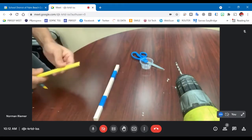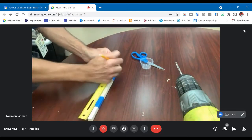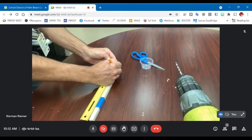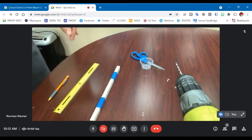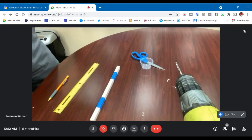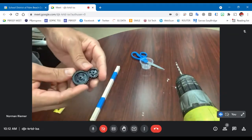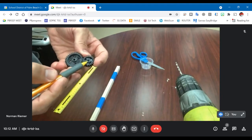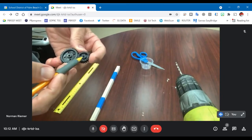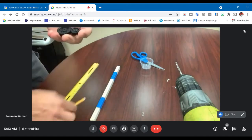For the back wheel, I'm going to make one hole that's two centimeters from the end. For the third hole, what you need to do is find your gears and measure the distance from the center of one gear to the center of the other gear. Here you can see my gears. I want to know the distance between the center of this hole and the center of this hole — that is the distance you'll measure onto the frame for the second hole in the rear.